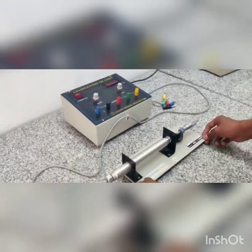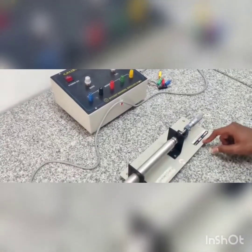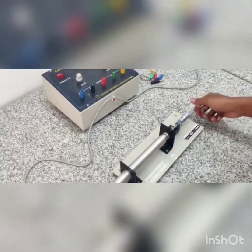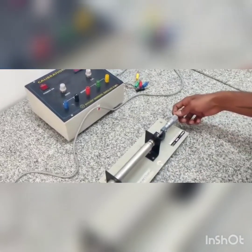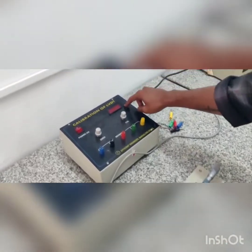This is the equipment of our experiment. This is the Linear Variable Differential Transducer. It works on the principle of mutual induction, which consists of two secondary coils and one primary coil. It is a hollow cylinder which has a soft iron core inside, which can be moved through the micrometer. The micrometer movement can also be displayed on the digital display unit.